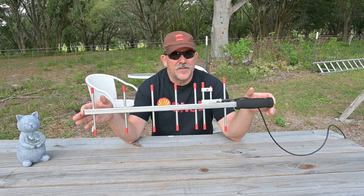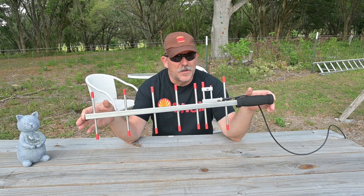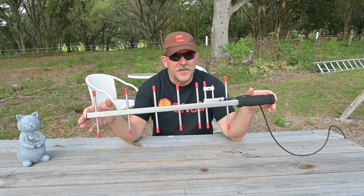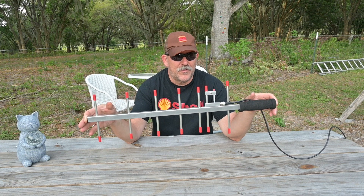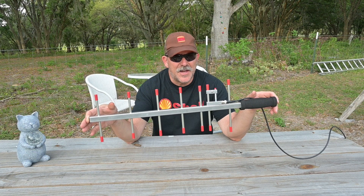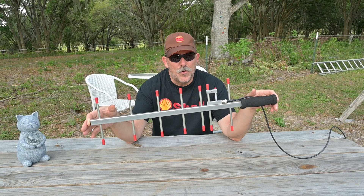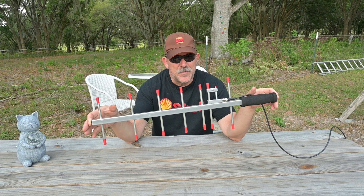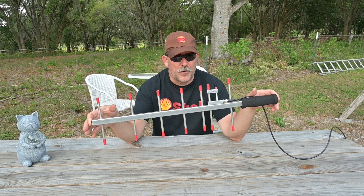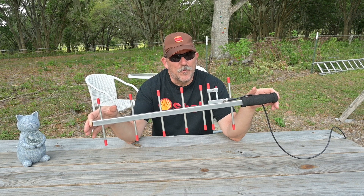This has been an interesting test, and I spent far longer doing so than I had envisioned. The Yagi works well in the input range, but I was shocked at how well the log periodic did against it in the 800 MHz output range. In the input range where it's cut for, it did outperform the log periodic in directivity and gain, but the difference in the output range really surprised me — it had me questioning my methodology, but I changed up every potential variable including location and the results were consistent. I really enjoy making this content, and I hope this helps. This is Brett from Survival Coms. Till next time.